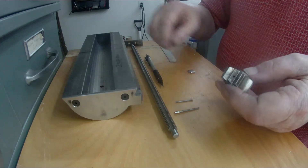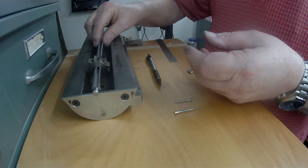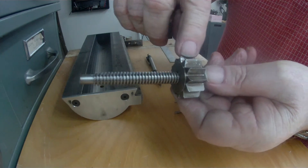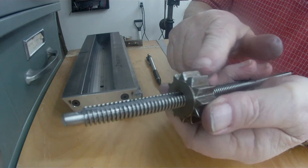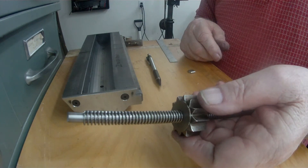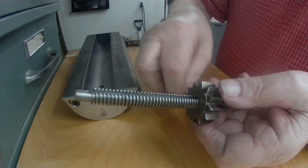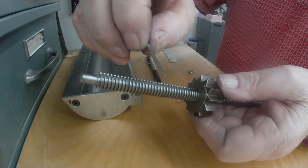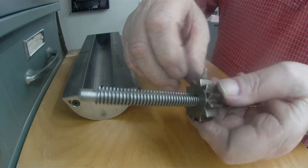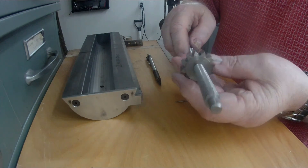When it's all complete, I'm going to be assembling this on here and it will sit down in there. I drilled a hole in the face of one of the teeth and came out the other side — it was a 0.061 diameter hole. After drilling the hole I used a little tapered pin, a tapered dowel reamer, to ream the hole out through there.